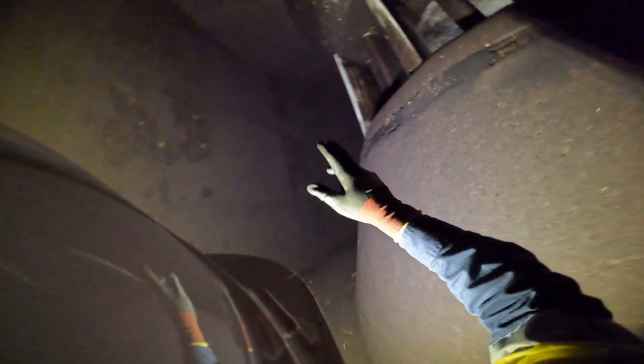Two sections here. We are looking at the spiral case. This directs water in a circular pattern so that it hits the runner in all angles. We get debris through here, which is quite large. We're walking up through the curved spiral casing. It starts off nice and big, and it slowly brings the water around in this cyclical passage. Because the energy is being consumed, we reduce the area and therefore keep the pressure constant on the water.